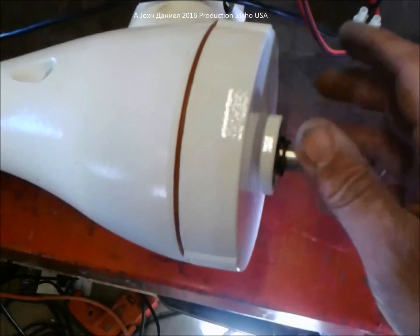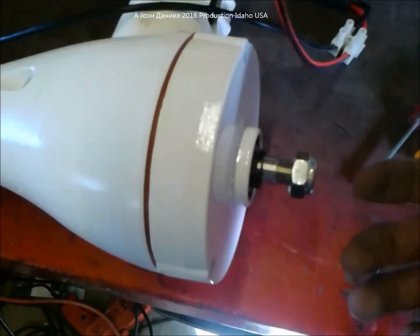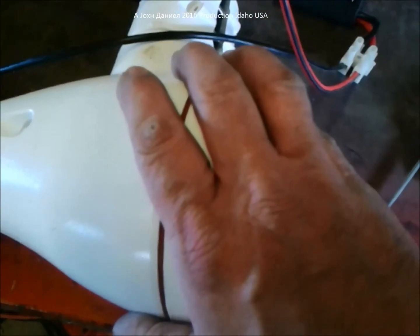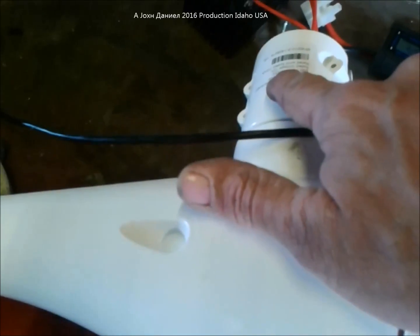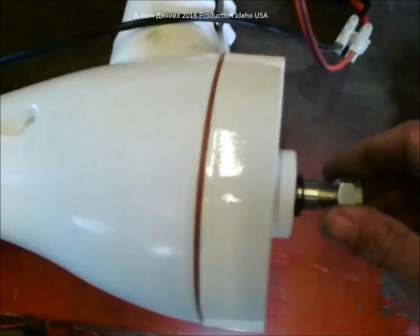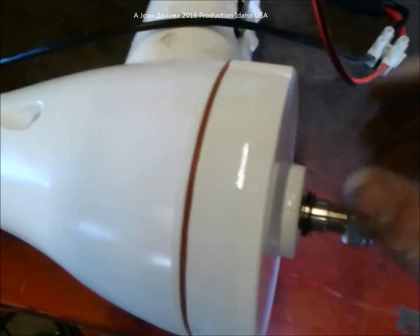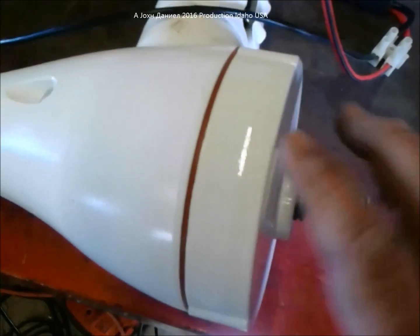This little generator has — I believe it's four-foot-two diameter blades. So if it takes four-foot-two diameter blades to make a normal output of 200 watts, with a peak output of 400 watts and a safety output of 600 watts — that's how this is rated as a 400-watt unit. But its normal output will be about 200 watts, about 16 amps, which makes it essentially a 16-amp battery charger.